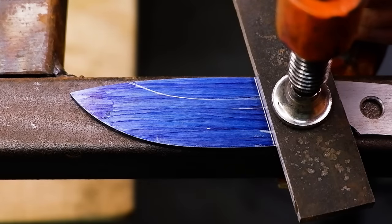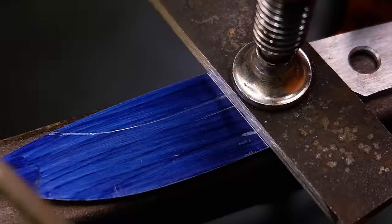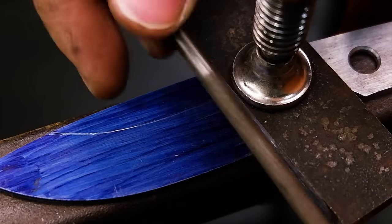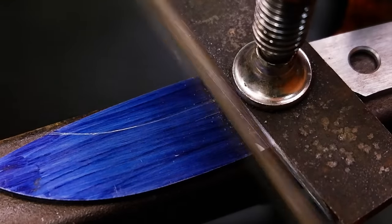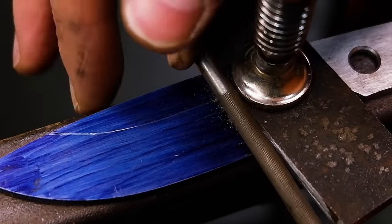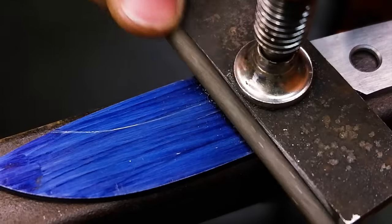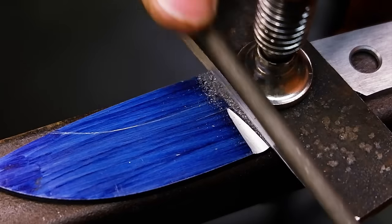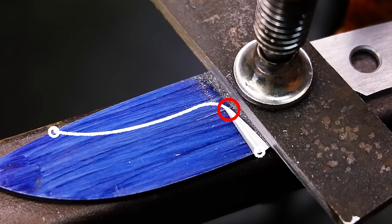I am using a piece of straight offcut steel as a file guide to make sure my plunge lines are filed evenly on both sides. File in the plunge lines using a 5mm chainsaw sharpening file. If you are using a thicker stock, like a 5 to 6mm steel, I would suggest using a larger diameter 10mm round file. Remember, I want a round radius where my plunge line merges into the bevel, so I'm only filing up to the first mark.